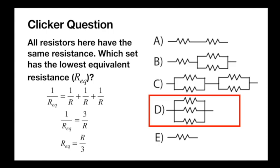In a circuit, it would be maybe I put in a battery, right? Now it's 10 volts here, 0 volts here, and so the charge is going to want to flow through. It's going to get forced through the resistor, and it's going to lose that voltage as it goes down, as it dissipates energy. Just like these balls, they dissipate energy. They lose gravitational potential energy. Here they would gain kinetic.